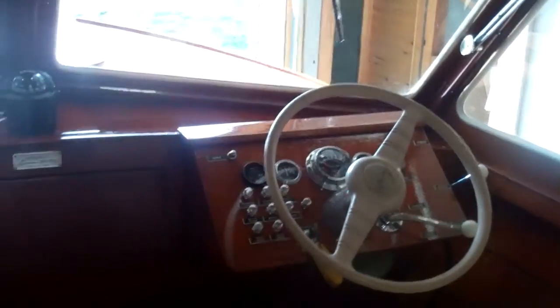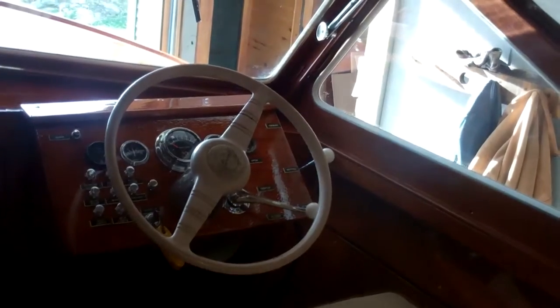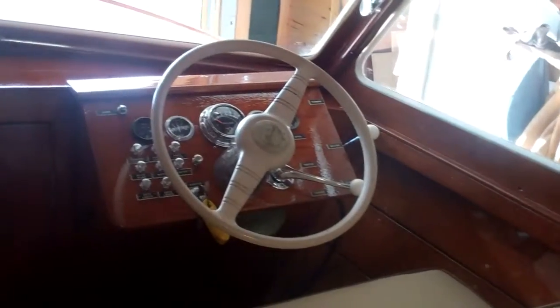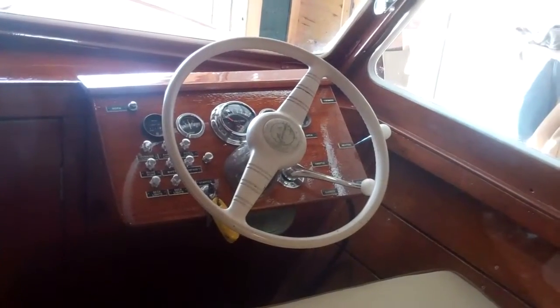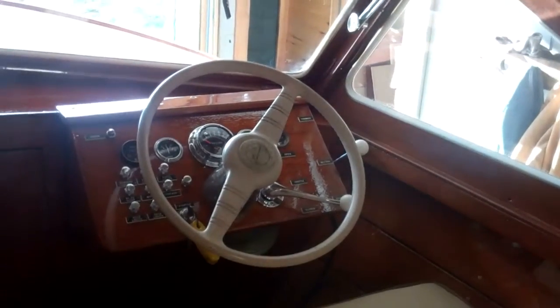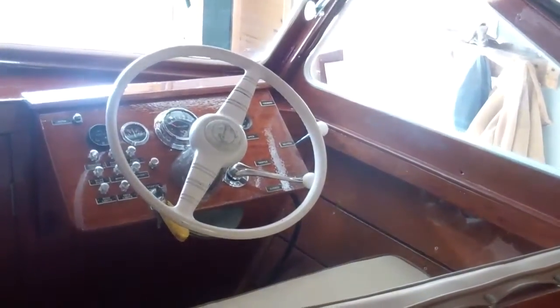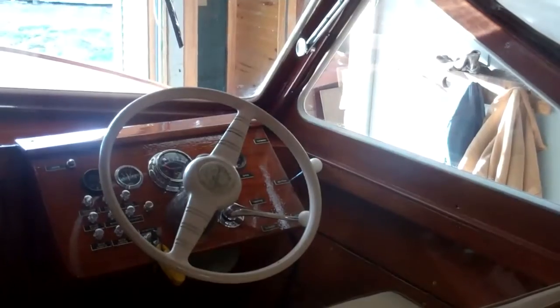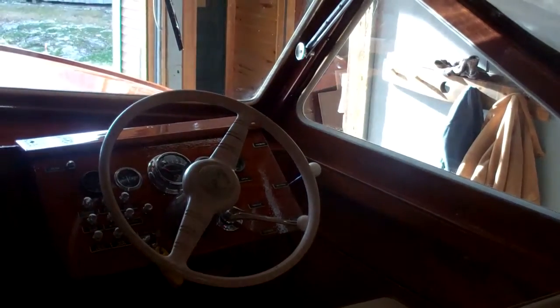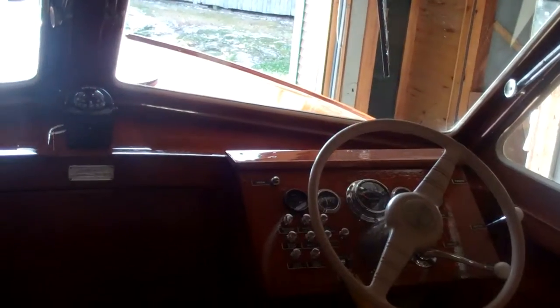When she arrived at Snake Mountain Boat Works, as near as we could tell, this Lyman had parts and pieces of 3 to 4 different wiring harnesses in her. Right at the engine box on the starboard side, down in the bilge, it was pretty clear that there had been an electrical fire, and some very enterprising person must have had a big roll of about 10 gauge to 14 gauge red wire. And why not just do it all anew with red wire? So there was this veritable rat's nest of red wire